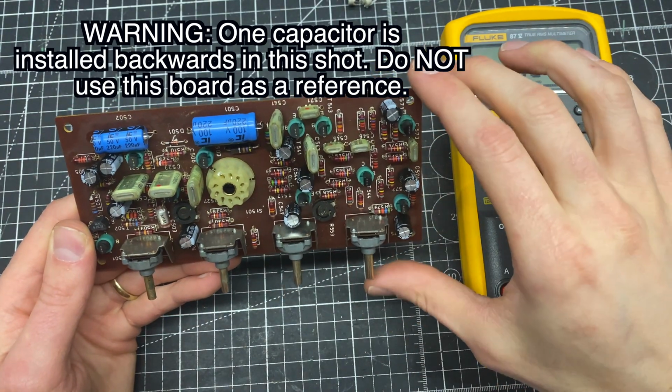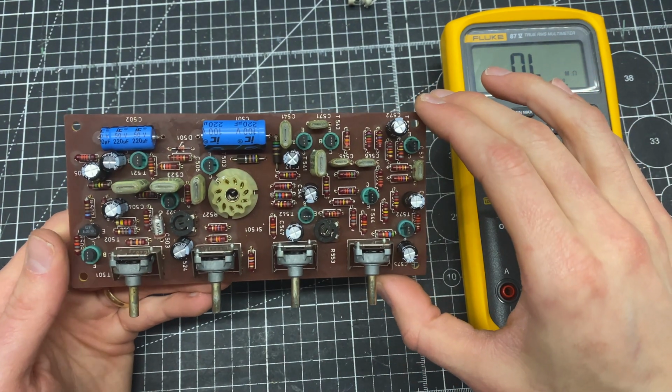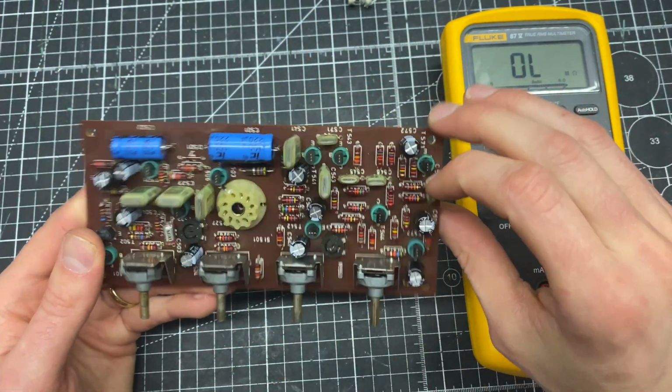All of the small radials were 10 microfarad. The schematic says something different. I think it says 1 microfarad. But I went with what was in the boards. Both of my boards were the same, so they all got 10 microfarad caps there, and then just a couple axial electrolytics up here and the Zener diode.